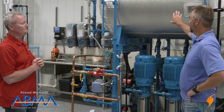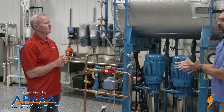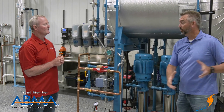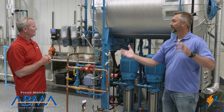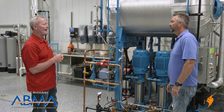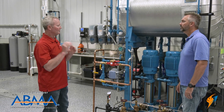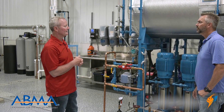So, what are the temperatures we're talking about in the deaerator? 225 to 227 degrees. Is that typical regardless of the pressure boiler you've got? It really doesn't matter. There are some systems that run real high-pressure and high-temperature boilers, but most of the time the boilers are designed for 225 to 227 degrees Fahrenheit.